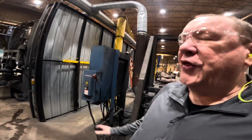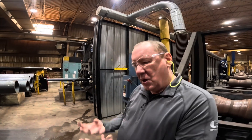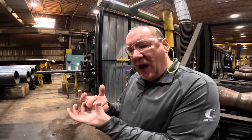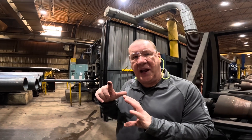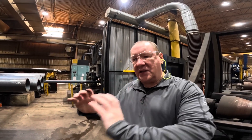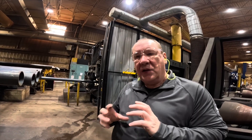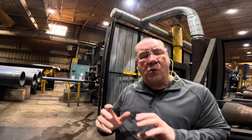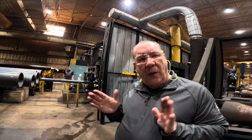Is anybody else hardening with a magnet like this? This is more expensive than what most people do. They use a flame — heat from one spot at the bottom while the pipe rotates slowly through. We found that heat treating all around the perimeter gives a more consistent heat, so when we cool it, it stays the same all the way around. When you heat from the bottom, you get small degrees of temperature variation as it rotates, so the pipe is not heated or cooled evenly.